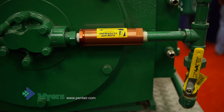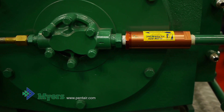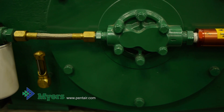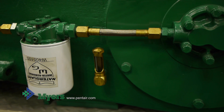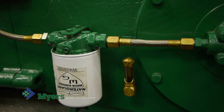It is a pressure lubricated gear end at lower speeds — you're not relying on splash lubrication. You can run this pump at its full flow rate of 120 gallons per minute and you can slow it down to 30 percent of that speed and get 40 gallons per minute, giving you a wide range of performance out of the same pump.